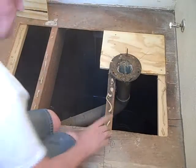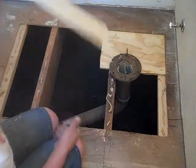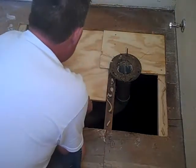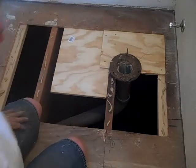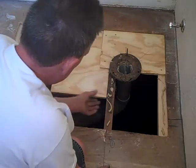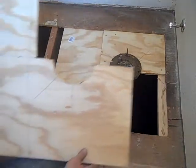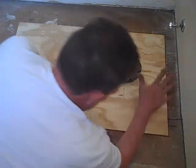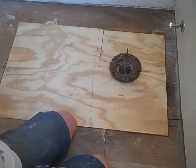So, similarly to these 2x4s, just some place for the plywood to catch, this is the leftover piece, and there's nothing wrong with it, so I'm going to use it right here underneath as a joining plate. So hopefully you can tell on camera, this is level with the floor, this is underneath, coming up. Is the other piece. And like I said, I already have liquid nails spread on this. Yeah, that's gonna work out just fine.